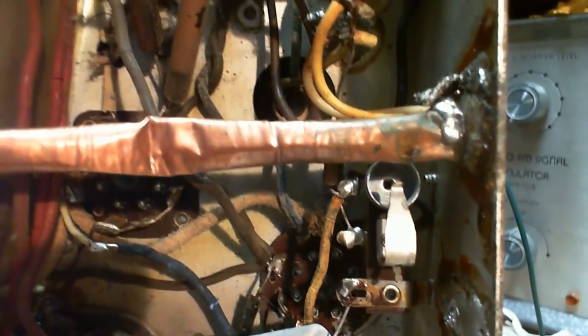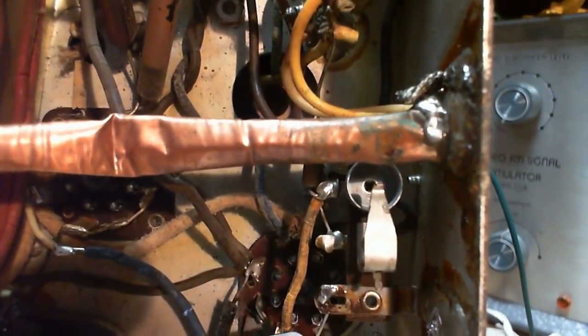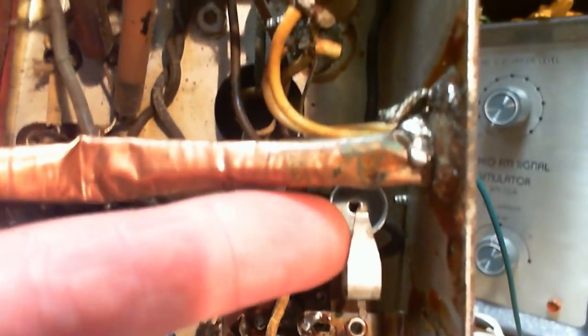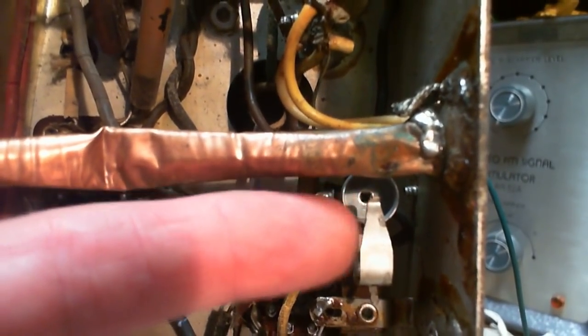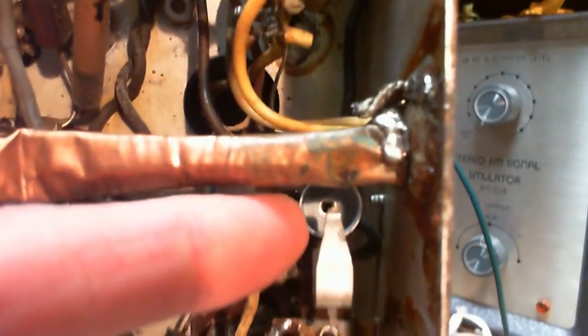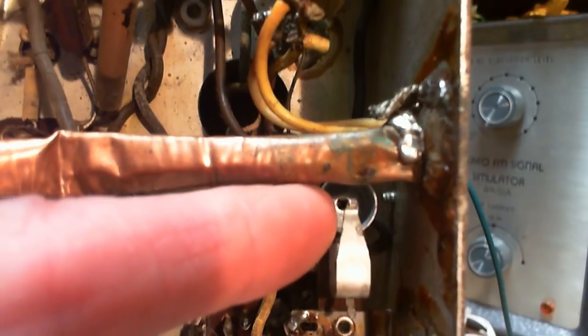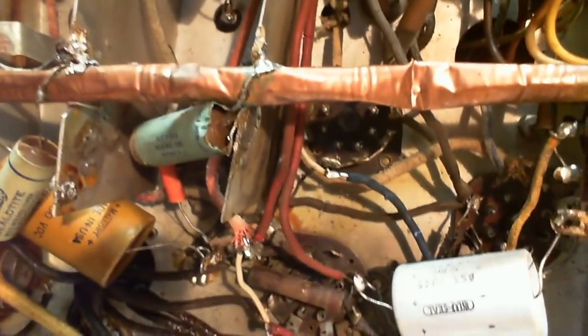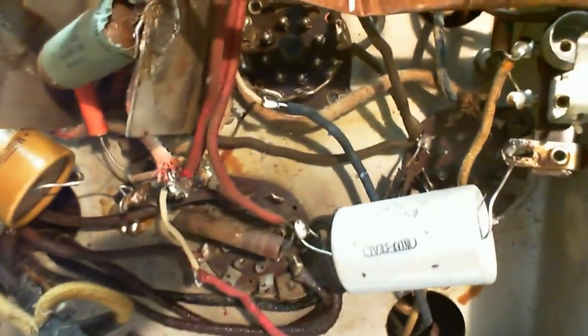If in the end we really want to get away from this, there's a couple things that can be done. One is you just short this out and give up on proper tube bias. Maybe not the best approach. Another way is to shove a modern battery in here, I've done this. In some cases, you can get a regular watch-type battery to sit on this or in this and be fixed in place if you're lucky. So there's a couple ways around that. And the other one is, stick some water on this and be happy it lasts however long it lasts before you have to wet it down. Maybe you install some little water pipe, and every 6 months drip some water down the pipe into the back of your radio.